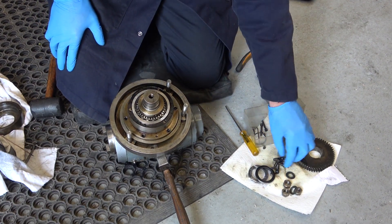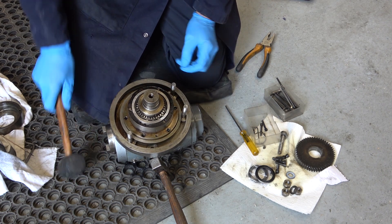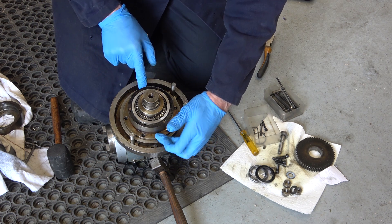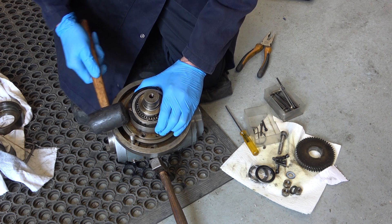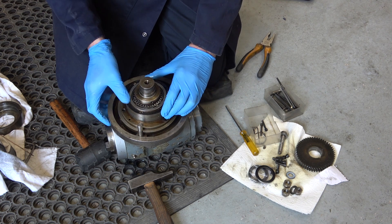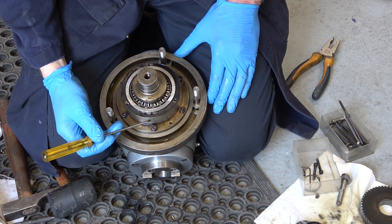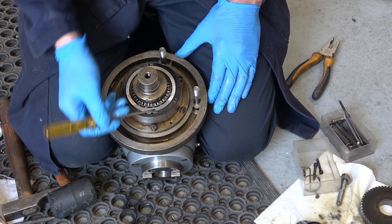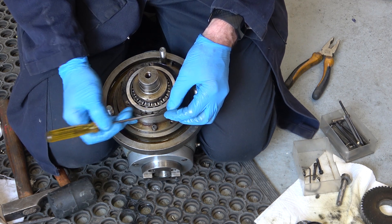All six of those cap heads were the same size and length. There is actually a hole there and one at the other side — if this is round by one position, I think somebody thought those holes ought to go across at 90 degrees. I can turn it but it's not lifting off, which is okay. I think these holes were probably to take a key of some kind. There are three holes for the oil — that one, that one, and one there — so one is completely covered up and the other two are partially covered. I don't know whether somebody made a gasket for this; it doesn't look original, so I'm going to cut it a bit to open up these holes.